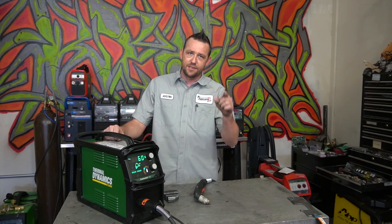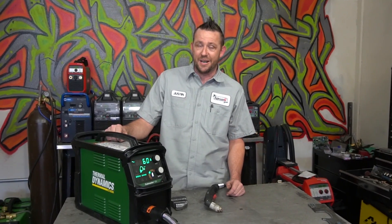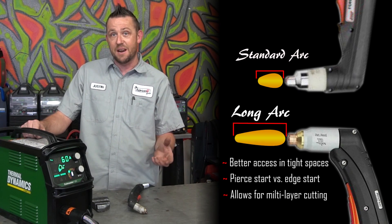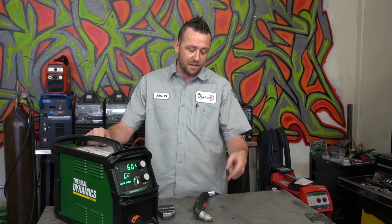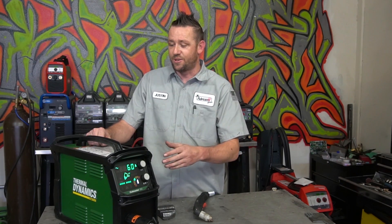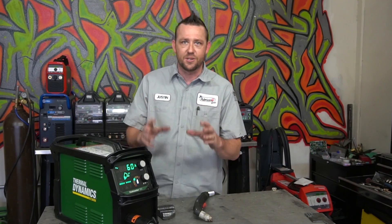I really can't lie to you guys about this. As soon as I cut up that car in almost record time compared to all the other cars I've cut up over the years, I was pretty much sold on it. What really sold me was the long arc — the ridiculously long arc length that it actually comes off the plasma cutter, meaning it will slice through multiple layers of sheet metal. Any other plasma cutter I've ever used for that meant you had to cut out large panels, find there were more layers underneath, or just make an initial cut and chase the rest out with a saw. In this case, the long arc went through every single piece of metal I threw at it beautifully. It really earned its nickname as the Beast. However, let's go through the rest of the testing and put all those claims and specs to the test on some seriously thick metal and see what it does.